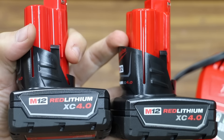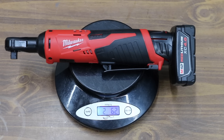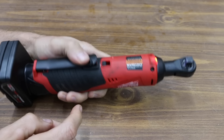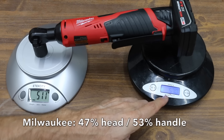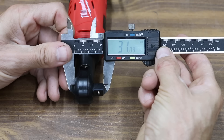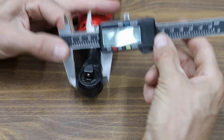The Milwaukee M12 charger comes with two 4 amp hour batteries made in Korea or Malaysia with additional processing in China. The Milwaukee weighs 2 pounds, 6.2 ounces — 1,083 grams. It does have a lockout feature which keeps the tool from powering up accidentally. With 511 grams on the head side and 570 on the handle, the Milwaukee is the best balanced tool yet at 47% weight on the head side. At very close to 81 decibels, the Milwaukee and ProStormer put out about the same noise. The Milwaukee also has the most compact head design at 31.12 and just 29.66 millimeters.